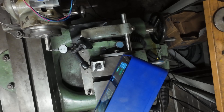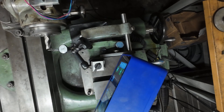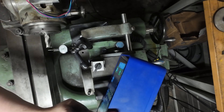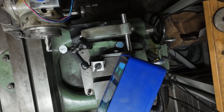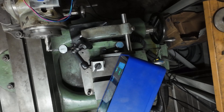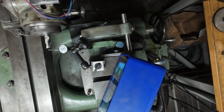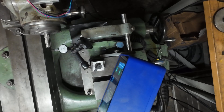Let's do a double check. We have the tip reading zero. Let me go to the next index — I'm at 2.2 millimeters. Let's read the same position on another flute: 2.2 millimeters — reading zero there, perfect. Let's go to the next flute, also 2.2 millimeters — zero, spot-on. And the last flute at 2.2 millimeters — pretty close to zero. I think this is good enough for us to start.